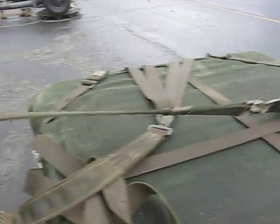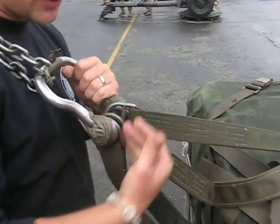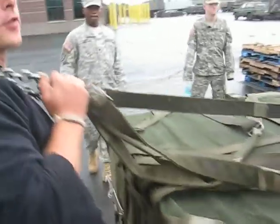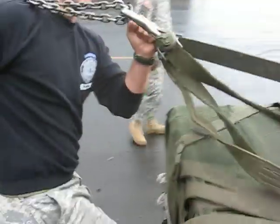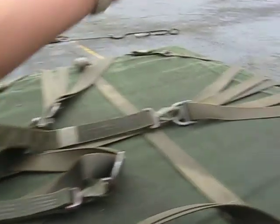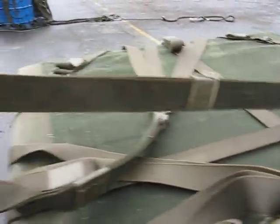If it gets that twist completely out, you're good. We already know we're moving left, so we don't even need to fiddle with finding our number three — just start moving in that direction. It's going to lift up off the load and be right in front of you. You're going to reach forward: make sure that your straps are flat, your hook is down, it is taped, no more than half a twist. All three of these are going to fall on top of the load; the one you're inspecting is going to lift up off the load waiting for you. The straps are flat, the hook is down, it is taped, no more than half a twist.